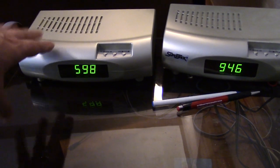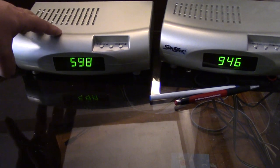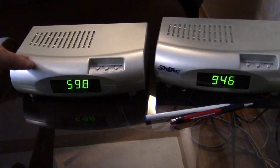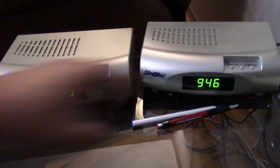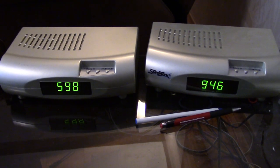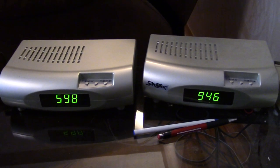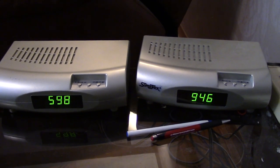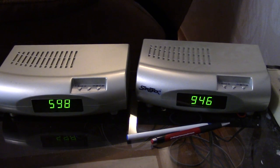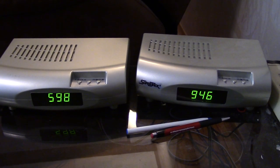I like to tinker around, so I might put like a CKU band LNB on here, but because of some of the weak KU band feeds, I want to be able to use this. And then this one here, I use for my 8-foot C band dish. So I can get the best of both worlds and have a dish for both of them. I have had my dish with the CKU LNB as well. There's different configurations. You can set it up however you feel that you'll want to have your dish set up.